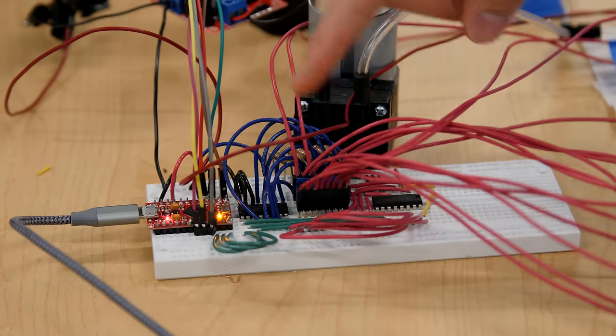One of the main takeaways of this soft sensor is that it's relatively easy to make — basically just a couple of layers of silicone, and then one layer of carbon black and ecoflex gel. You hook it up to an Arduino, inflate it, and you can get some data out of it. It's a pretty simple setup. You have an input with electricity on one side, and then you're measuring the change in resistance by taking it out to an Arduino, where you can map it onto a plot showing the change in resistance as a function of time.